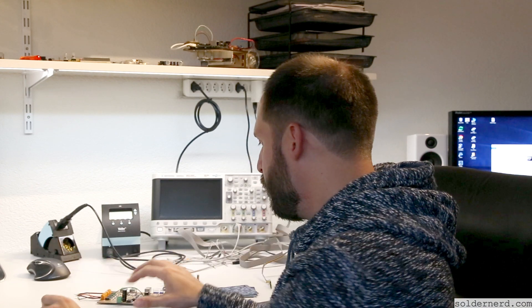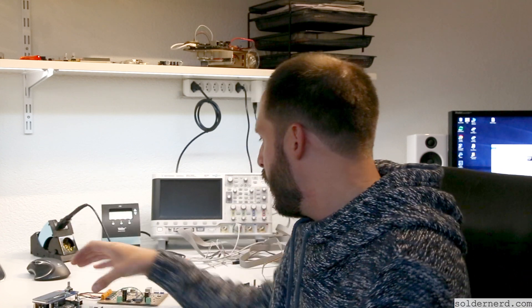The result was this charger that was far more complex. There were two keys to achieving low power consumption while implementing all those features. Number one, almost everything on this board can be turned off — as a rule, if something is not in use, it's entirely powered off. And number two, I've replaced the Arduino Uno with a PIC-18 microcontroller that uses hardly any power when it's sitting idle. This project has evolved from there, through revisions C, D, E, and finally F, as I've entered it for the Hackaday Prize. As you can see, they are now built on professionally made boards, but the main design has remained the same.